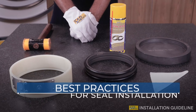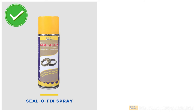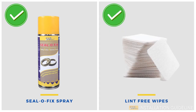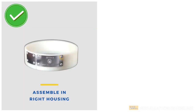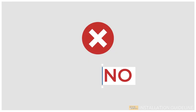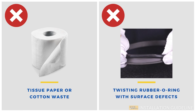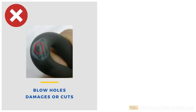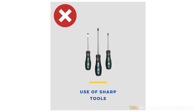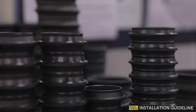Here is an exhaustive list of best practices, preventive measures, and cautions to take before and during installation. Say yes to: using SAP Parts Seal-O-Fix spray or approved lubricants; carefully using lint-free wipes or cloths only to clean sealing edges from dust and dirt; assembling both seals together in the right housings; and repeating all steps if the seal is not installed correctly. Say no to: usage of tissue paper or cotton waste; twisting or misaligning the rubber O-ring; using rubber O-rings with blow holes, damages, or cuts; unclean sealing surfaces; and hammering or using sharp tools to locate O-rings. Follow these step-by-step practices to experience a hassle-free installation and make the seals more durable and long-lasting in the field.